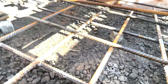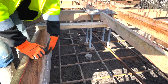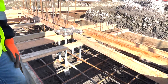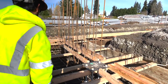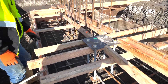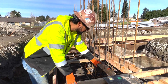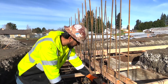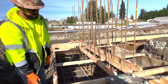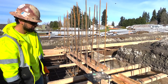It changed to number-seven bar — seven across and then ten inches on center for your transverse bar. When the inspector comes he's going to check your clearance — we've got three-inch dobies — and he'll check your spacing and make sure you have the proper bar called for, which in this case is number seven. For our formwork setup we use two-by-twelves; we call these clips. They hold the footings together and hold our templates, which hold up the uprights. Once you get your template up you do your layout — in this case 24 inches — and make sure your anchor bolts are in the proper place.